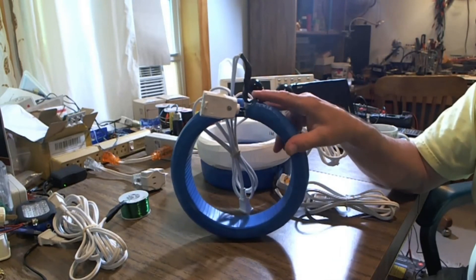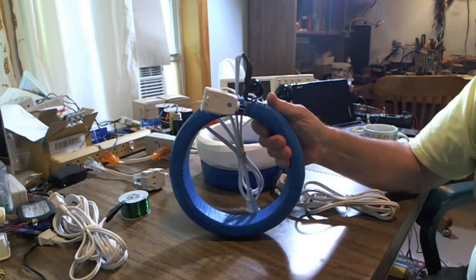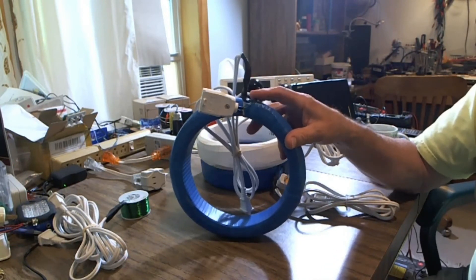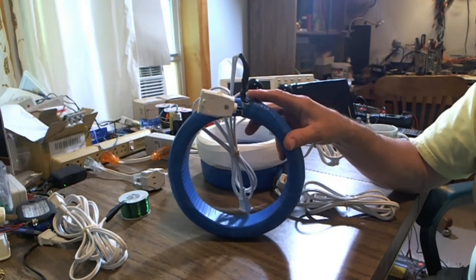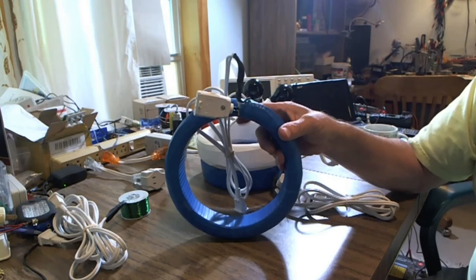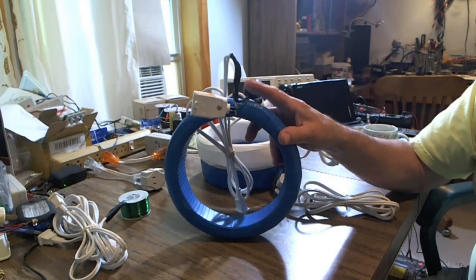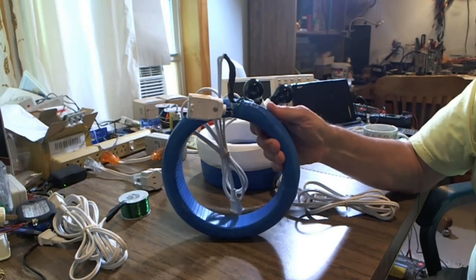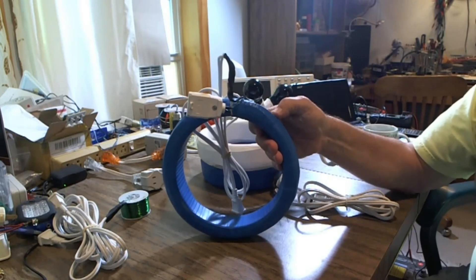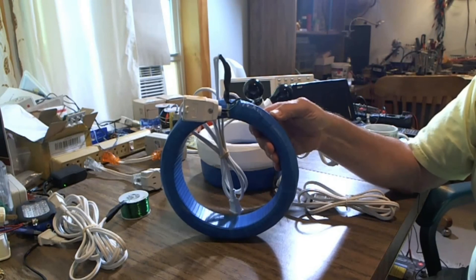I didn't need to put two 12-gauge windings in, and plus it would have been too heavy. The coil as it stands is already too heavy for my wife to use, so I've made a single-wire version of just 12-gauge for her — a lighter coil. I'll be making a video on the coils as time allows, and I'll include the mono version and call it a mono versus a bifilar coil. The bifilar has more advantages, but more material cost and takes longer to build. The mono coil still has 168 feet, is lighter, and is still one unbelievable magnetic pulse delivery device.